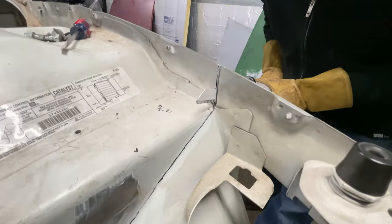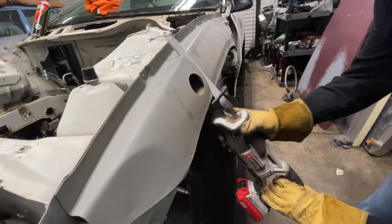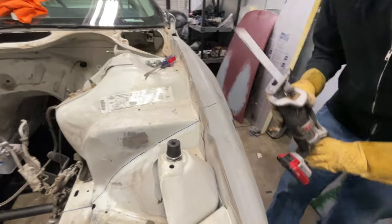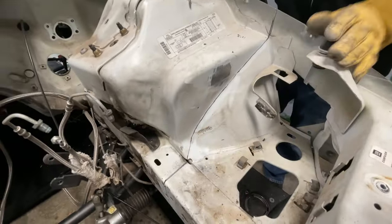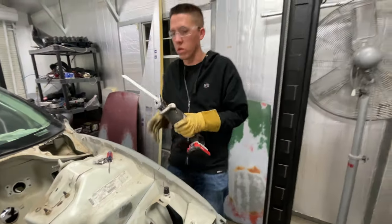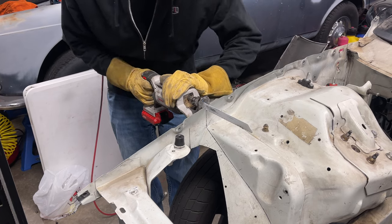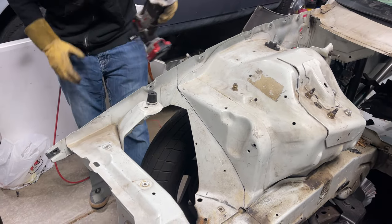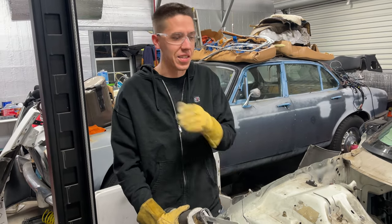I'm a little on the inside of my line. There's the first main cut. I'll take a four-inch cutoff wheel and cut down through here, then maybe jump inside and cut the frame rail with this. I don't like that you don't have as much control, but we still ended up pretty square with that one. It doesn't take long to get this thing cut off — it'll be off here pretty fast.